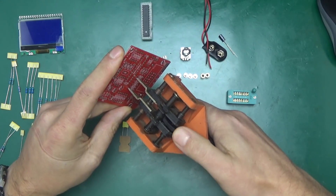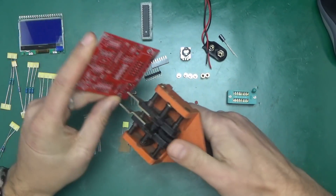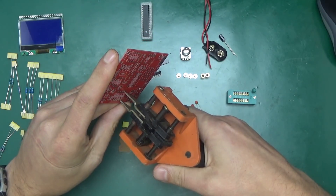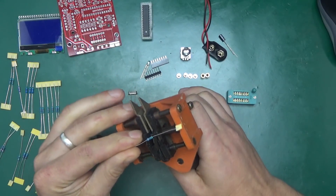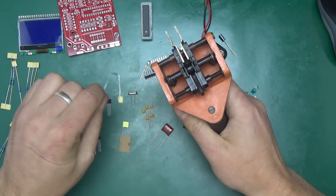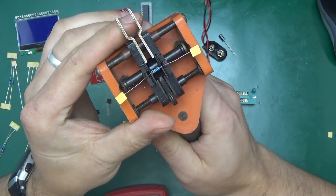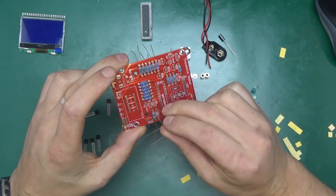Because resistors can have different distances between the holes in the PCB, you can adjust the bending width by turning this knob. Whatever the distance between the holes, as long as the legs fit, it's set to the right width. So we wind it down to just about right for our pitch, start bending legs, and they come out precisely the width required for the holes in the PCB.